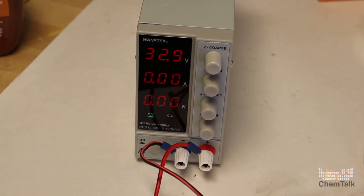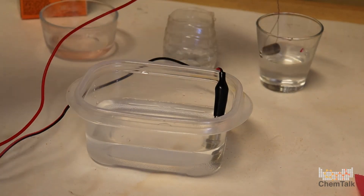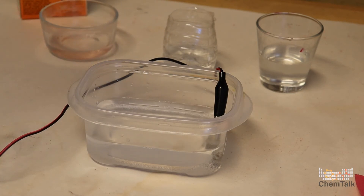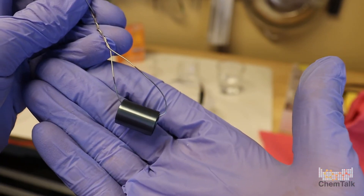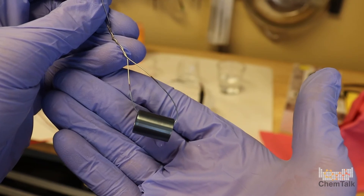Now we have our power supply — I'm going to set this to 40 volts. You can do anything from about 18 to 120 volts — just be careful, this is not low voltage stuff, so make sure you don't hurt yourself. I've got our part soaking in the distilled water. I'm going to dip it into our solution and leave it there for a second. Pull it out. Turn off our power supply. What color is this? It's like a very matte blue, almost like a gray-blue color. I don't think it's the color we're really shooting for, so we're going to do it again.